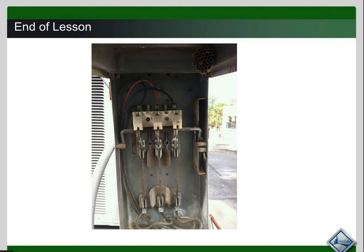Here is some of the things I have seen. One of the things I've seen with copper pipes — this just happens to be wires put in here — on a 480 volt system. For whatever reason, they put wires in instead of fuses. That can cause some huge issues.